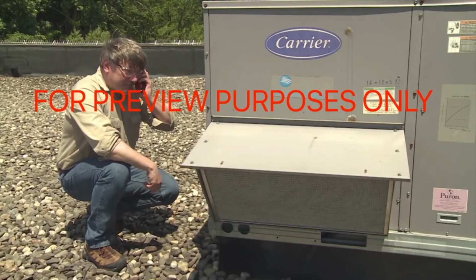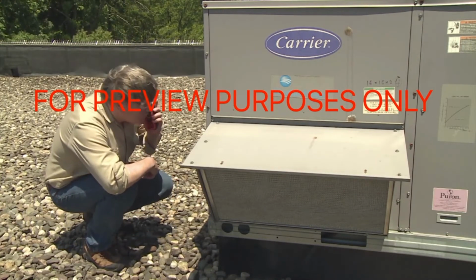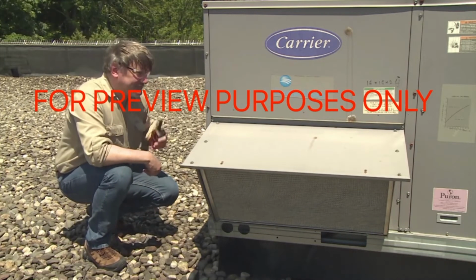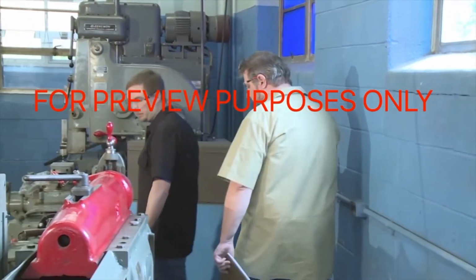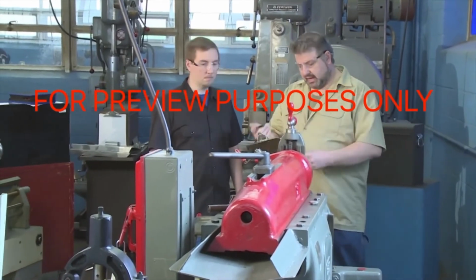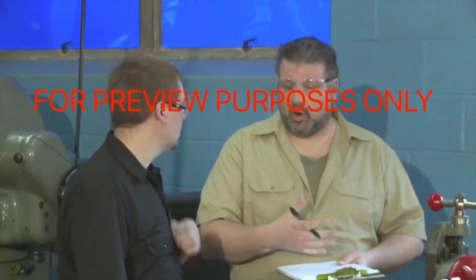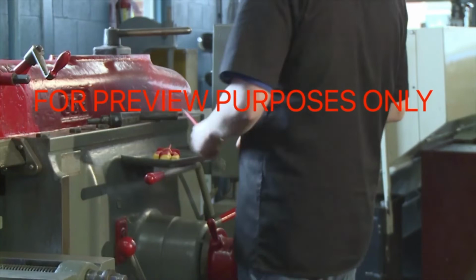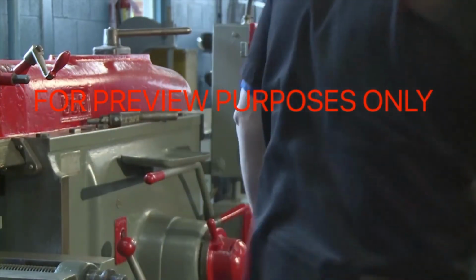If you cannot start the equipment and verify that it is functioning correctly from the location where the lockout-tagout devices have been installed, you should use the buddy system for this testing. During some lockout-tagout procedures, such as when equipment is going through a prolonged shutdown for rebuilding or major maintenance, situations can arise where a machine must be temporarily restarted. In these cases, this temporary startup should be handled exactly as a normal release and restart.